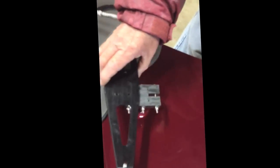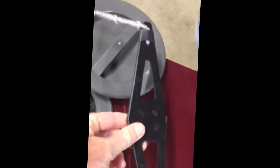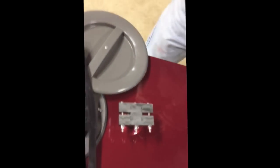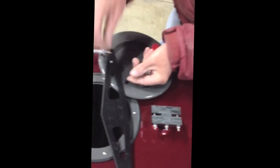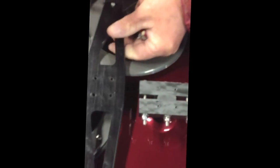So we're going to go through this kind of step by step, and the first step is we're taking the yoke off here. We've undone all the fasteners there, and this is the yoke on top of the rudder post, and that's coming off. The reason we're doing that is because we're going to put a bungee cord underneath, which we'll show you in a sec. Those come right out there, and then we're putting those all in a nice handy-dandy bucket, so we know where everything is and don't lose any of our little parts.